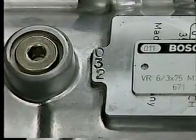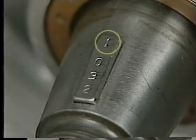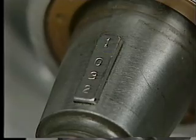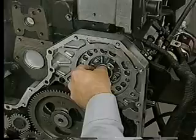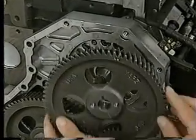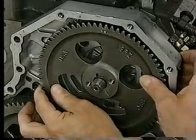Previous injection pump mount keys were not specific. An arrow stamped into the top of the key should always face the pump — if installed backwards, a DTC may be set. When installing one of these injection pumps, be sure to have the keyway at the 12 o'clock position to prevent the key from falling into the gear train. There are no adjustments to make to the pump drive.